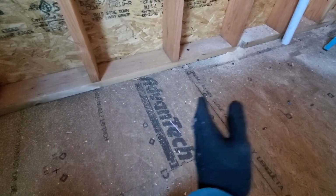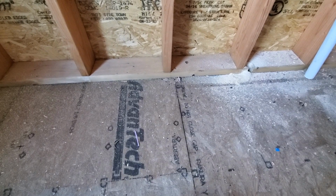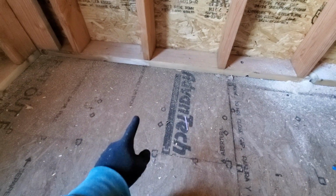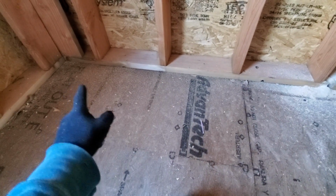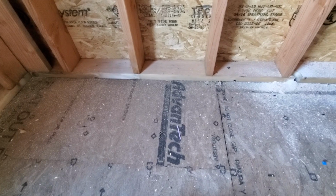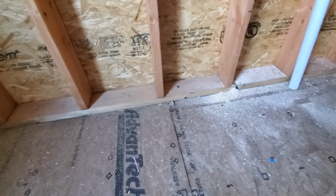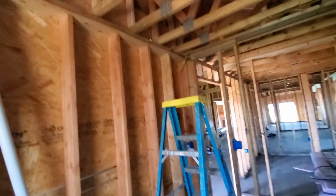We're actually going to have more room here because this is my 8-foot line if we do a 96-inch vanity. So I'm actually going to slide this point over until I'm 18 inches off of that point, not off the wall. 15 is doable, but it gets a little tight. So anyways, I'm going to push the toilet this way to give us more room against the wall. Natalie usually likes to have magazines and stuff like that next to there anyways. So that's the goal for now.